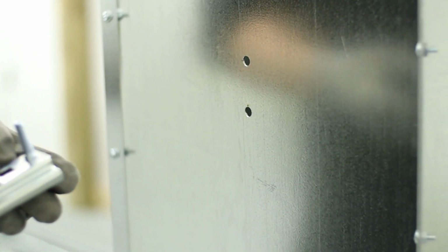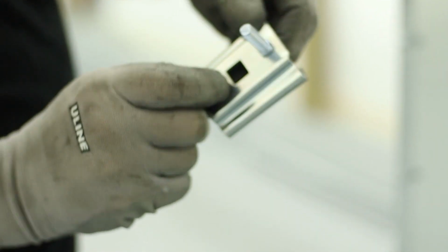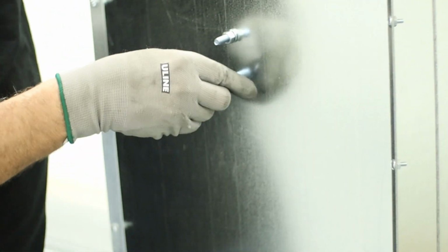That has carriage bolts. And it's angled, so you want to set the wide angle at the top so you can slip that right in. Set that into pre-drilled holes. I'm using a lock nut and a lock washer and a lock nut. I'll put this on.